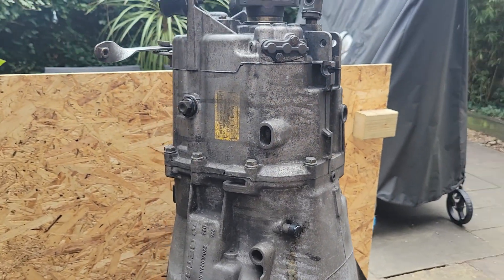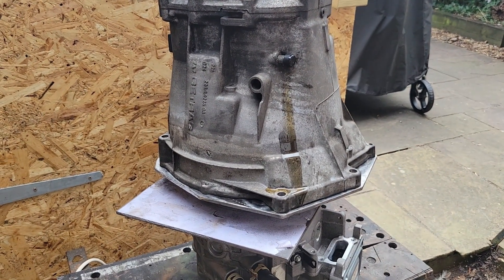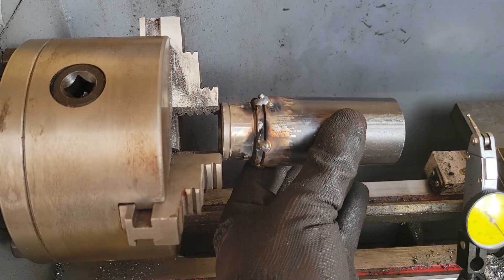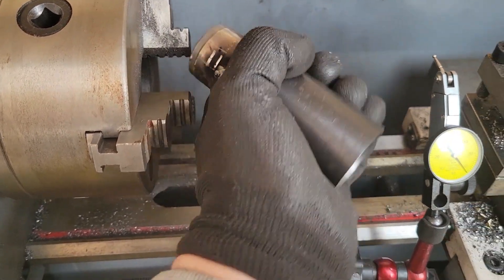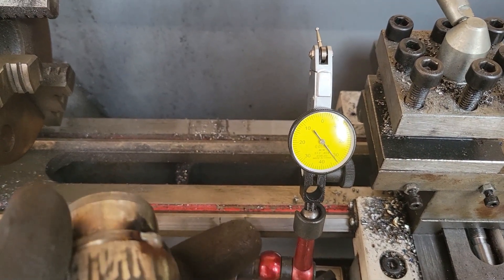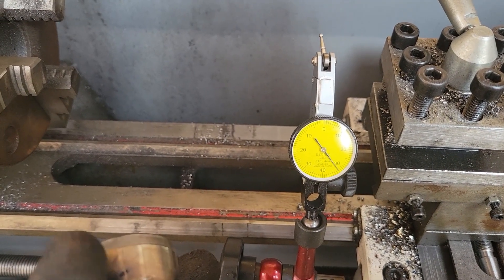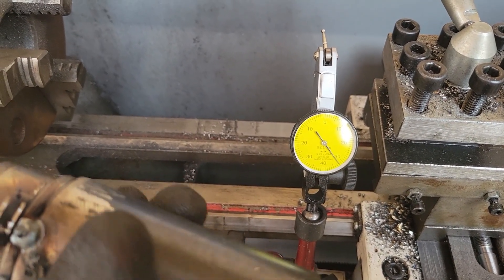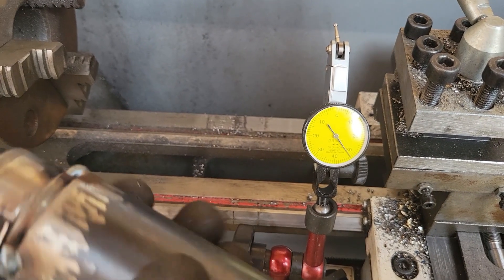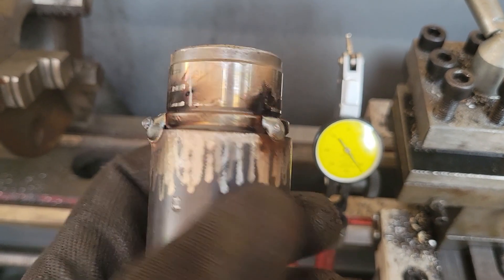Because the coupler's not fully welded up yet, I don't get any movement in the two plates. So now I need to get that coupler — now that it's the right length — nice and straight and weld it up. A little bit of off-camera work: we've had the coupler in here, been spinning it around with the dial gauge. With this set up, about a tenth of a millimetre is probably as good as I'm going to get. It's just slightly less than that now, which is probably about where my existing coupler is, and that's fine. So I've stuck some tack welds on.